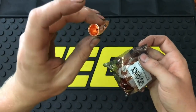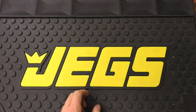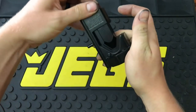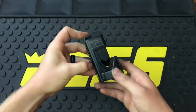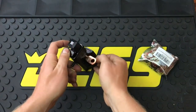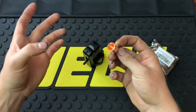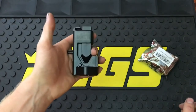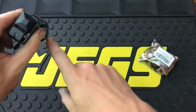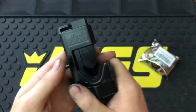If you're worried about crimping these, you can use a screwdriver and a hammer or a punch and hammer, or you can get one of these hammer punches. It's a spring-loaded steel shaft with a punch-type end. You put your lug and cable in here, the spring helps hold the lug in place, then you take your hammer and tap it down — that crimps your lug to your wire. These run anywhere from $15 to $30 depending on the brand. This one has a metal strap around the bottom so you can mount it to a workbench. It's a Temco — it'll be linked in the description.